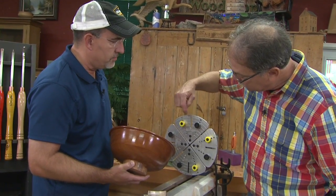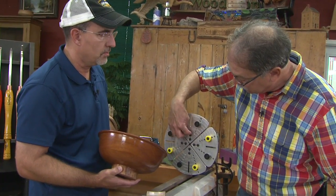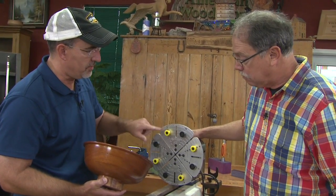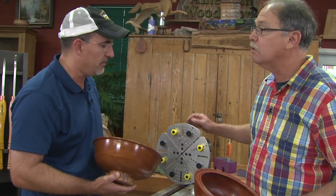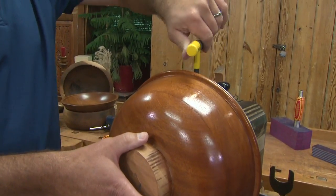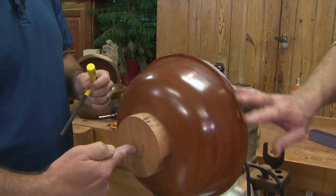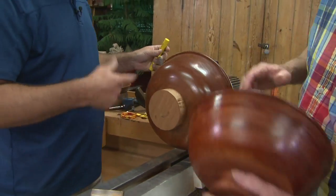We've selected the right bolt circle for our project size — you can measure and do a little math, or just eyeball it. We have concentric circles on the plate as a guide. You can also travel the grippers up and down the post, and even take the big jaws off and post it in for smaller vessels. We'll offer a little adapter washer, and ultimately you'll be able to screw the gripper right into the base jaw to grip inside a tiny hole or hollow form. When using the Big Easy Jaws, don't apply a large amount of force — with a thin wall, too much force will bust it. Just enough to grip, and use the tailstock for additional support.